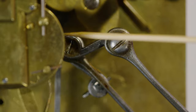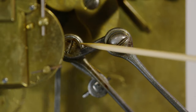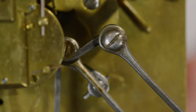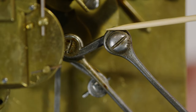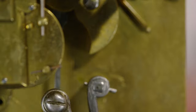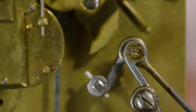So at this moment, this lever is exactly in line with the crank, and so if I just had that one alone, if I tried to move it, it wouldn't know necessarily which way to go. But because we've got the second lever here, it's got the full right angle to push, and so the other one will go over top dead center and bring it round in the same way again.